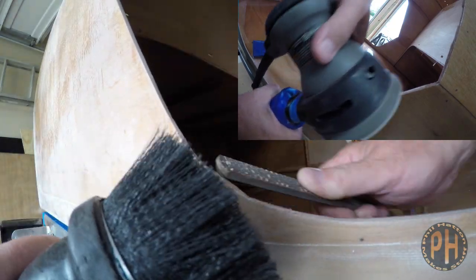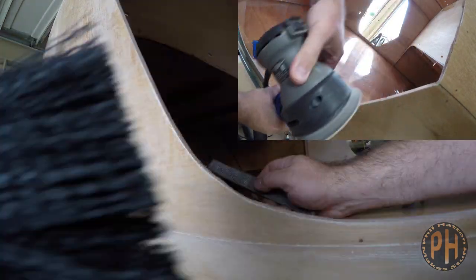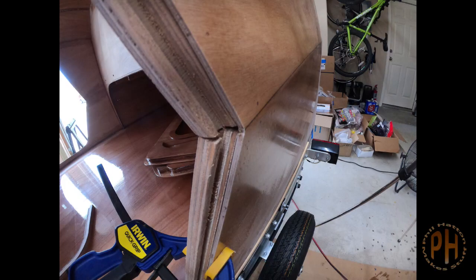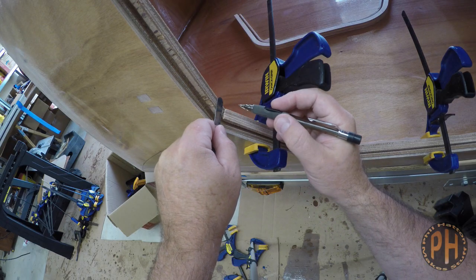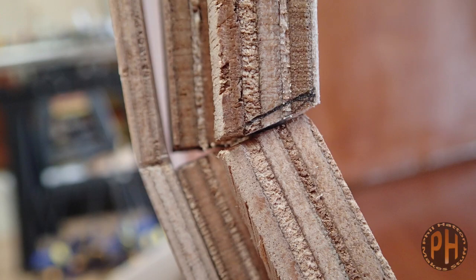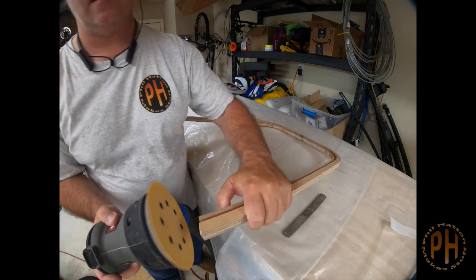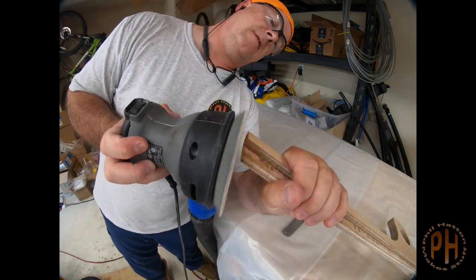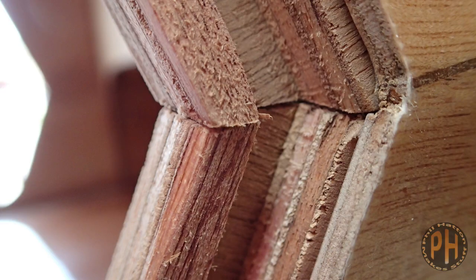There was some anxiety in making sure the door sill fit well. If it didn't line up, I wasn't sure the door would close. In the end, I did have to do some sanding and adjusting to make sure the door stiffener cleared the door sill, but now it fits nicely. I sanded and cleaned up the rough edges on the door sills, and I test fitted everything several times. I did a little shaping to get the two pieces of the door sill to mate up properly, and check to be sure the groove that is part of the weather seal on the door sill lined up and wasn't filled with epoxy. Once the sills were fitted and spaced evenly around the cutout for the door, Amy and I glued the sills on with epoxy thickened with cellophil.